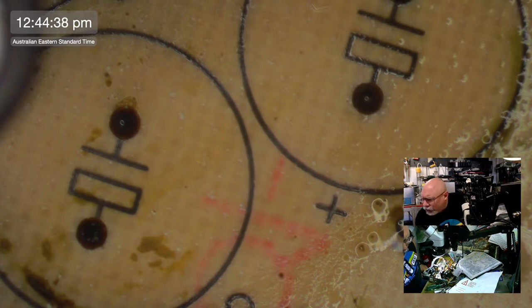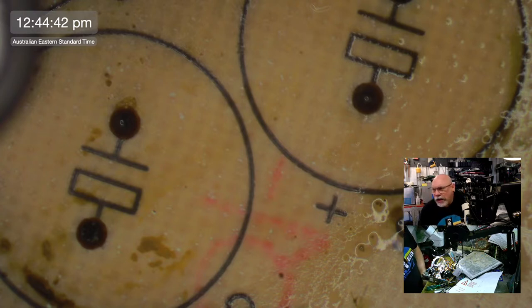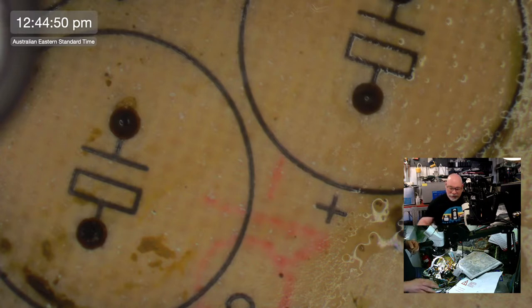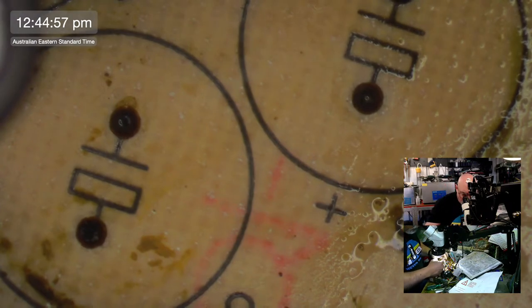I do leaded solder at 250 and go up to 350 for lead free, and I thought I was overdoing it with that level. I get in and out really quickly. I ordered an inspection microscope for an end of financial year treat, as I'm making more and more tiny things this time. Yes, microscopes are very handy things. I actually think every home should have one. Even just for removing splinters, they're absolutely fantastic.